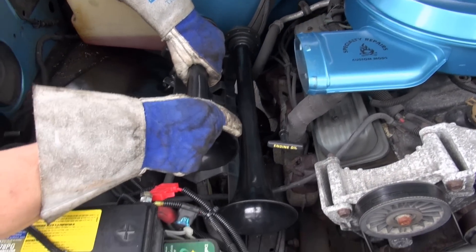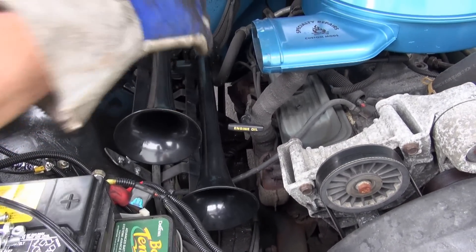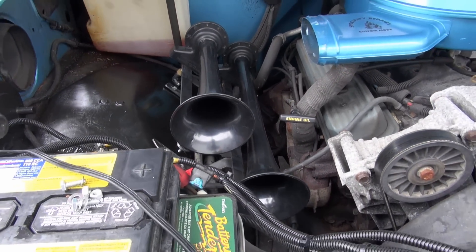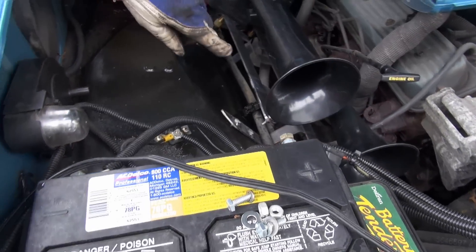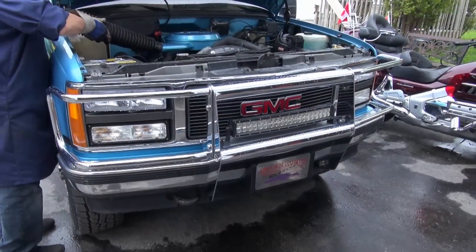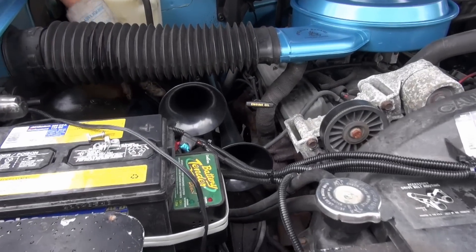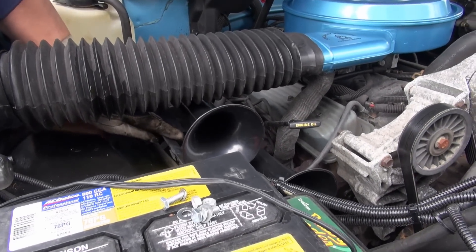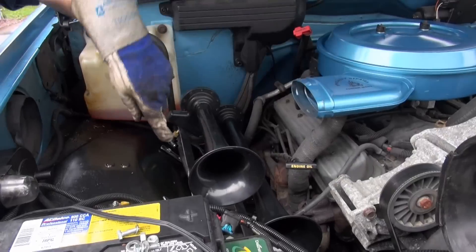This is how it's going to look. Wow. Now what I'm going to do here - I've got two holes there, I don't remember what they're for, so I'm going to pull them out and make a bracket that comes out with a support bracket going here. I don't think it'll have any effect. That's going to go past the snorkel. I've got lots of room there for a bracket. So what I'll do is I'll put another bracket down here and tighten up the bottom bolts. If I think there's going to be any vibration, I'm going to put another bracket from here to there.